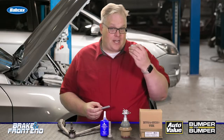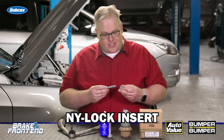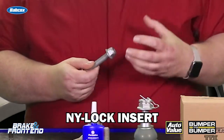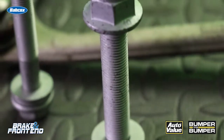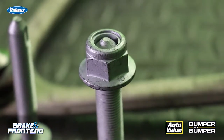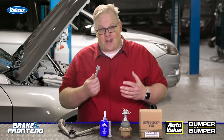The next way to keep a nut in place is known as a nylock insert. This is a hard nylon material on the female nut that grips the male threads to make sure the nut does not come loose. There is controversy about whether nylock nuts can be reused, but if you have the option, use a brand new nut to ensure that fastener stays put.